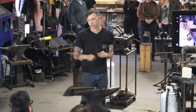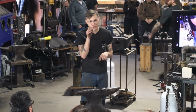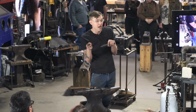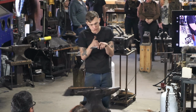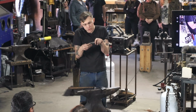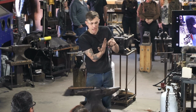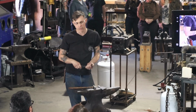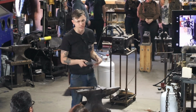There's something known as the 2-inch bite, especially on longer knives like chef knives, and you get a little divot 2 inches in from where you start grinding because the other side of your platen did something that you didn't realize was happening. So if we could really try to focus all of our efforts, just that ever so slight tweak in the angle so that we're really digging in almost diagonally across our platen, we're going to get our best grinds. It's something that most people probably come to without ever planning or thinking about that happening.